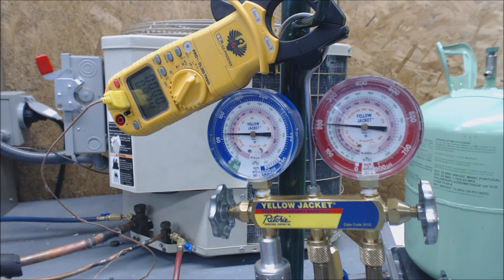This saturated temperature — if you follow 205 PSIG over to the green saturated temp, the saturated temp for R22 says 103 degrees saturated state. So we have our hose attached right here at the service port, actually trying to read the saturated temperature condition right in this area of the condenser. Right after it turns into a liquid, between here and where it comes out, is going to be your subcooling reading.